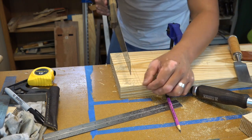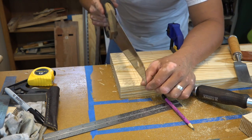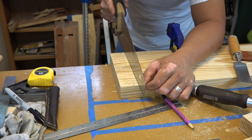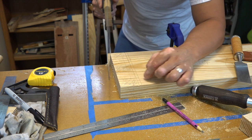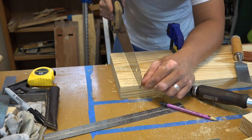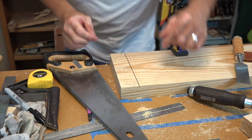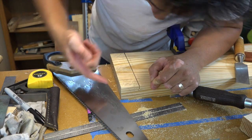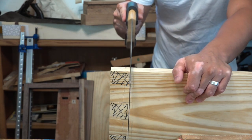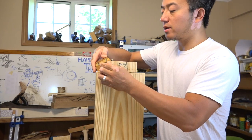So now I'm just going to cut across the grain here. The saw I'm using is a crosscut saw — most saws you'll buy at a hardware store are going to be a crosscut saw. I'm really trying to stay on this side of that line. I definitely don't want to cut into the tenon in here. When I took these chunks off, I lost two of the guidelines, so I'm just going to put this thing back on there so I know where I cut.